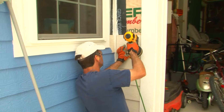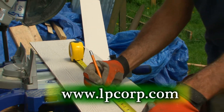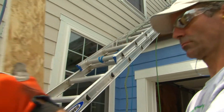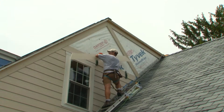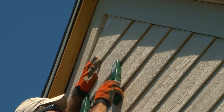At the same time, I installed LP SmartSide trim and siding. SmartSide is an engineered wood product — an alternative to fiber cement siding, but since it's made of wood, it doesn't have the dangers of silica dust that fiber cement has. SmartSide is lightweight and comes in 16-foot lengths. With a pair of hands-free siding gauges from Pack Tool, I was able to install all the siding on the house largely on my own, saving money on installation.